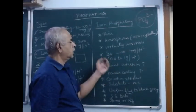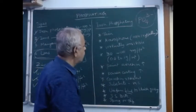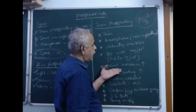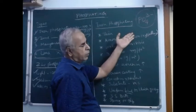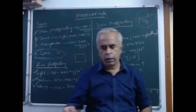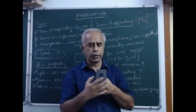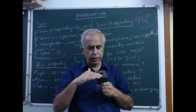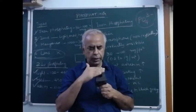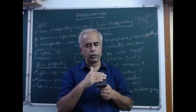In terms of grams, that is 0.3 to 1 gram per square meter. Paint adhesion is improved with the help of this iron phosphate coating. If you have any component, first you have to clean it properly, ensuring an oil-free, dust-free, rust-free surface, and then you can apply the iron phosphate coating.